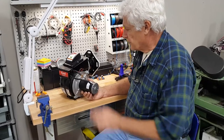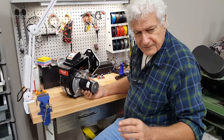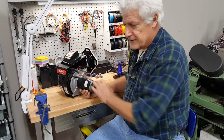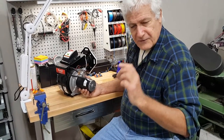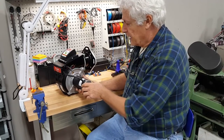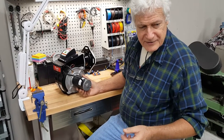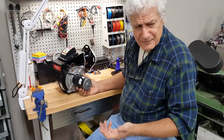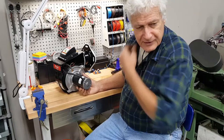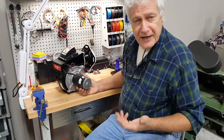In order to eliminate that, we made a circuit using solid-state components like transistors, and what it does is enable a small signal from the flow switch to activate a large amount of current to activate the relay. We're going to show how it works. This is a prototype made on a prototype board, so it's not an actual printed circuit board that will be used in production — but it can give an idea of what it looks like and what it does.